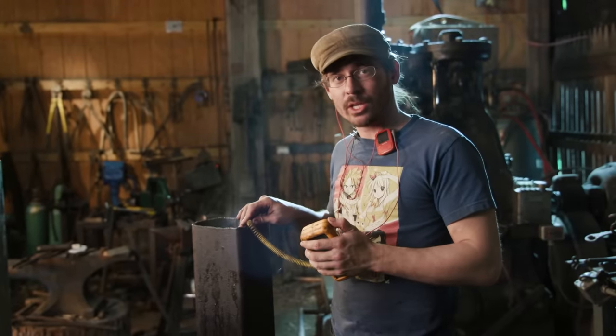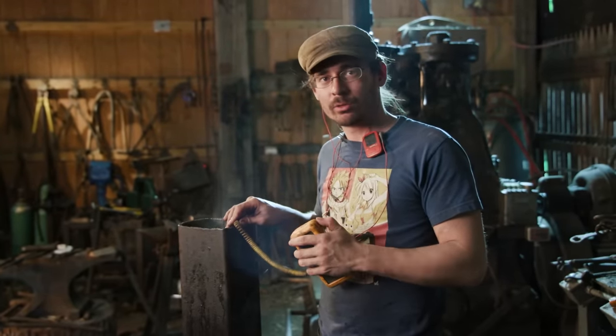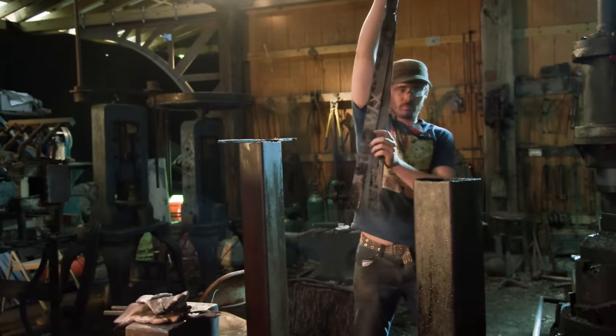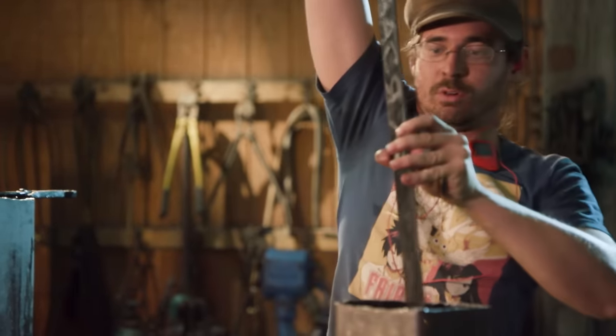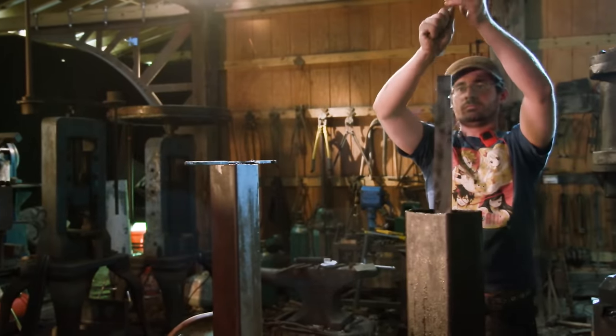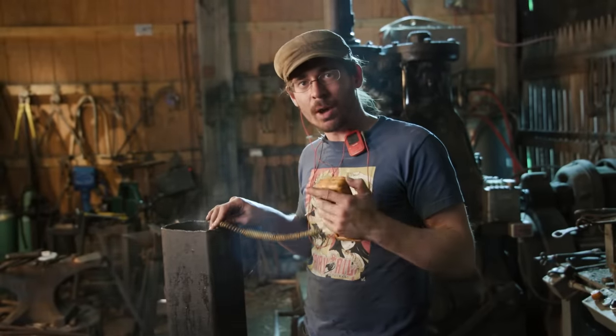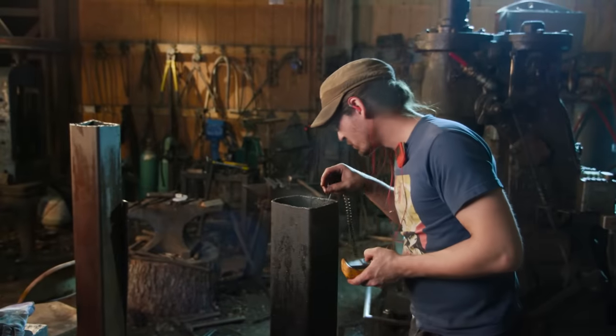After quenching, the next stage in producing a blade or any other tool is the tempering phase. Now, if you plot toughness and hardness on a curve in a relationship to each other, at about 400 degrees, the curve experiences a dip. That dip indicates a suboptimal performance at that specific temperature.